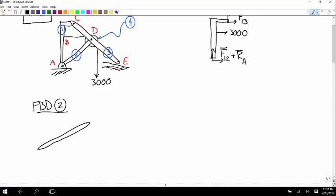Down at the joint A, 2 is only touching the pin, which is part of member 1. So this is negative F1,2. And then the pin at the top is part of member 2. So we have the force on 2 by 3. That pulley is also connected to that pin, so we also have the force on 2 by 4.